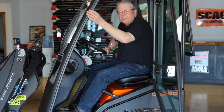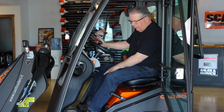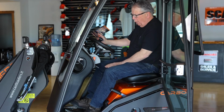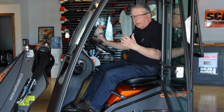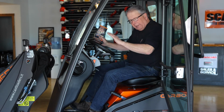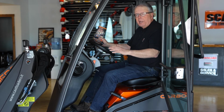The machine operates very simply, very functional with a steering wheel. For driving the unit, there's a pedal down below. The right pedal is your hydrostatic drive forward or hydrostatic drive reverse. The more the operator pushes the pedal, the faster the machine will accelerate. So he uses some good judgment as he's operating the machine, maintaining engine speed, but then also engaging the floor pedal to get the power and traction and performance he needs when he's digging.